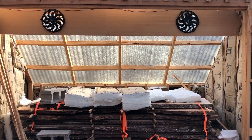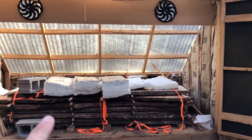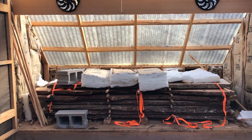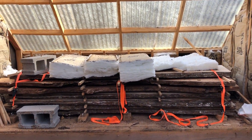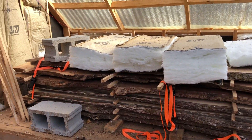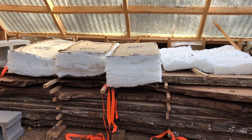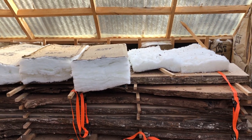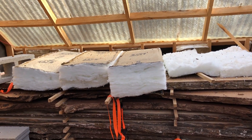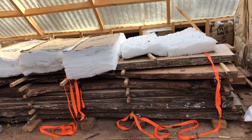Here's the inside. I did add insulation on the walls — eventually I'll do the back of the doors. This is the fourth load of wood that I've dried in here. This load has actually been in here almost a year, which is too long. It was dry within a few months; I just got lazy and left it in here and haven't done anything with it.